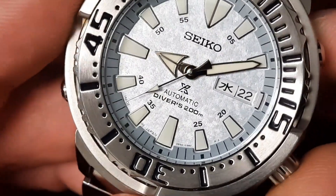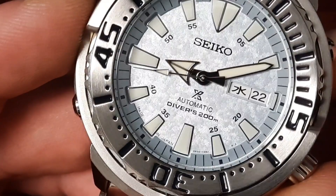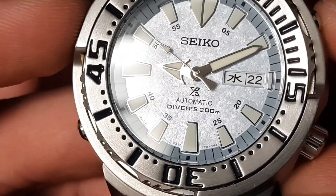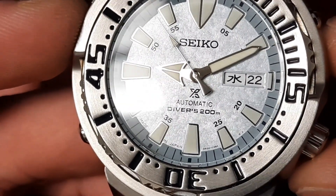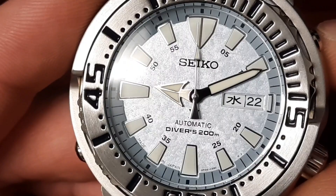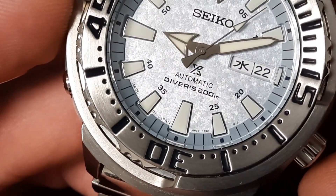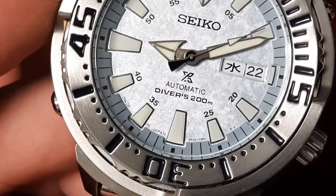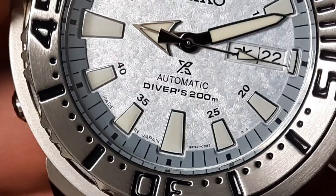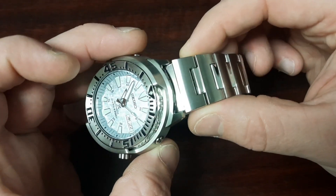We do have a fully polished handset — it's basically a monster handset with a sword-style minute hand and broad arrow hour hand, and they match quite nicely with the angular indices on the dial. We also have a day and date wheel complication, and I appreciate the use of a kanji day wheel. If you look closely at the seconds hand you can see it beating away at 3 hertz, or 21,600 beats per hour. Inside beating away is the 4R36 — Seiko's standard workhorse movement for this price range — which has hacking, hand winding, and a power reserve of 42 hours.